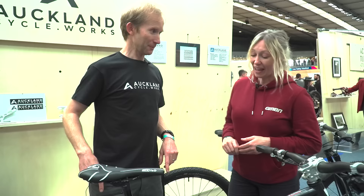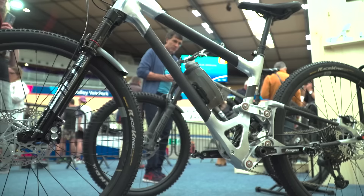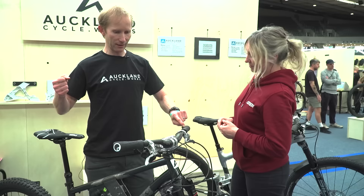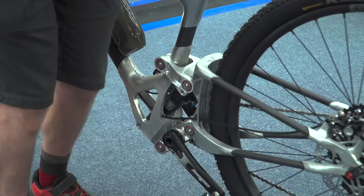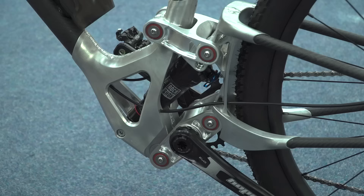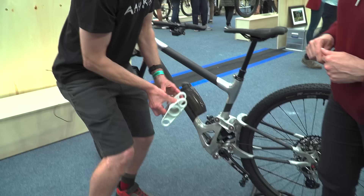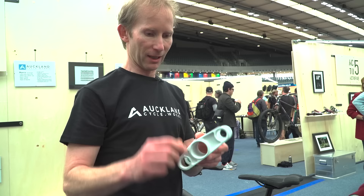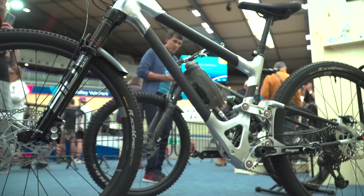As you're riding light and trying to carry speed it's got all the benefits of the rearward axle path. As you're getting aggressive and wanting to hike and stretch the bike around, the axle path is vertical so it doesn't continue to lengthen. You've taken everything you learned from this over to this second bike, which is more of a semi-prototype production version. I wanted to experiment with how to commercialize this and make it into a bike somebody's actually going to want to buy. The linkages move the same way — instead of the high idler being halfway along the lower linkage, the bottom bracket is halfway along the lower linkage. It's less travel and less extreme in its characteristics. With tuning options — fitting the bottom bracket piece different ways in the frame plus a flip chip — there are eight configurations, so hopefully one of those should be sweet.